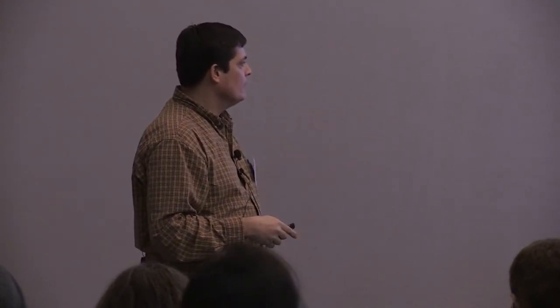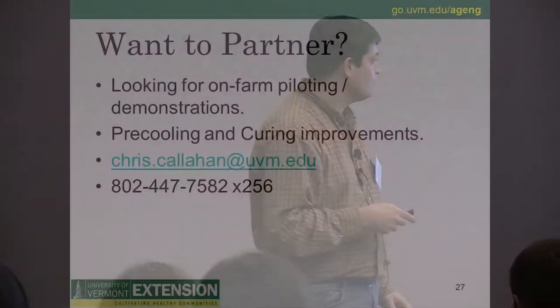So if you're doing this in a closed room and we have product that has been curing, and that room is closed, what's going to happen to the humidity in that room? It's going to go up and it's going to saturate, right? So we need to have some way of getting air exchanged in wherever we're doing this. Get the moisture away from the product and then out of the room. And then measuring for completeness, which is something we hope to have improved guidance on shortly.